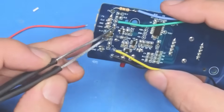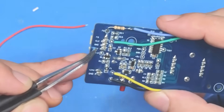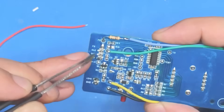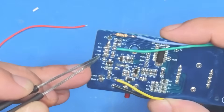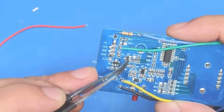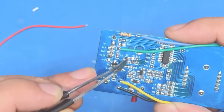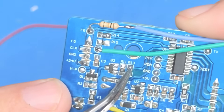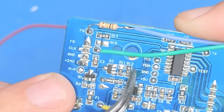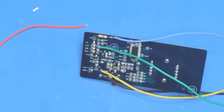The way this works: we've got a pulse going into this clock signal, but there's also a MOSFET which controls the 24 volt power going to the fan connector. In normal operation this microcontroller turns that MOSFET on, which powers the fan - when it's off the fan doesn't get any power. There's actually a pair of them. What we need to do is supply the gate to this transistor with a 3.3 volt signal from the D1 Mini. To do that I'm going to connect a wire to the top of R13. If you're worried about getting solder on there you can scrape this track off, but I'm going to solder directly onto it using a white wire.